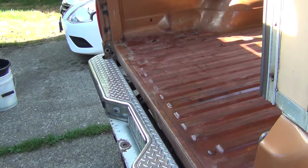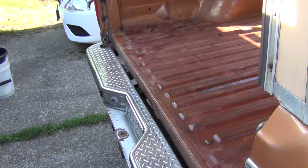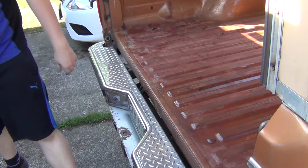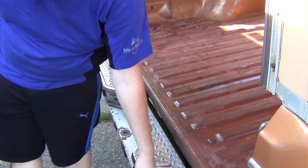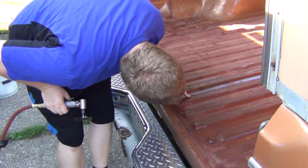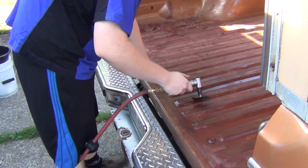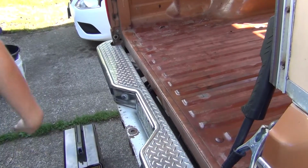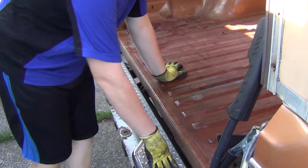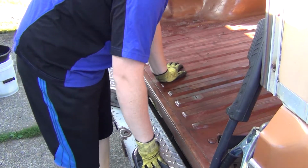I've been playing around with that welder for some time now, and I figured out that wire speed 4, I'm using the Harbor Freight, the $100 one. I'm using that, and wire speed 4, and then minimum heat on this kind of metal shouldn't blow through it. So let's just try, let's see, let's try right here. So I've unhooked the battery.